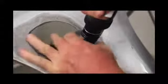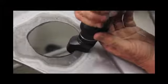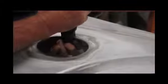The flange head attachment is actually going to create a profile in the middle — that's what dents or bends the metal. Using that flange head attachment, create a clean profile around the circumference of the area that you've cut away, overlapping each section by about a quarter of the total head size. If you find the profile isn't clean enough, you can go back and retouch different areas. You want to make sure that you've got a nice clean profile so you can easily get the replacement panel to fit within it.